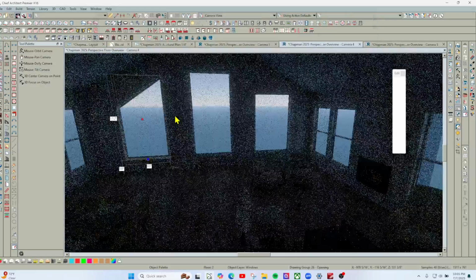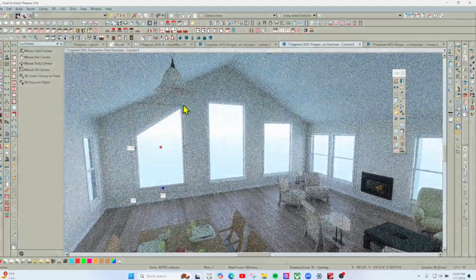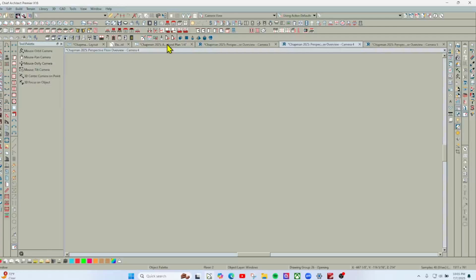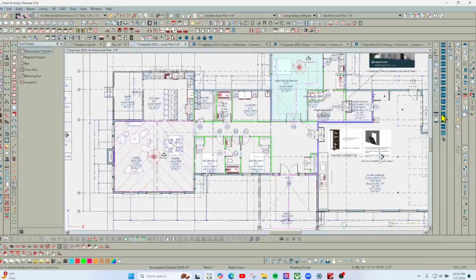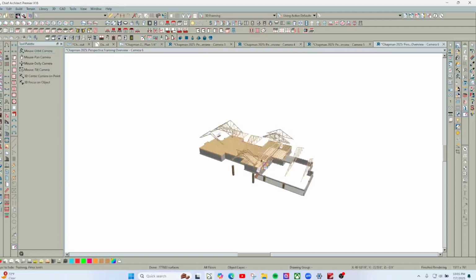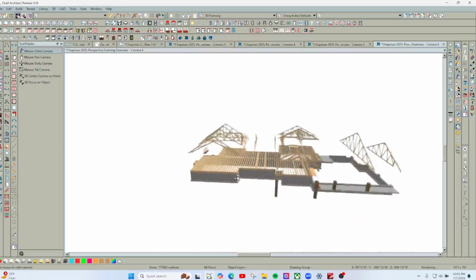you'll see it copies and mirrors the outside roof pitch, which is an 8-12. The inside of this is a 6-12, so that we can get our truss cost down. So you can kind of see here, I did go ahead and throw some trusses in there just to give us an idea where our profiles would be.